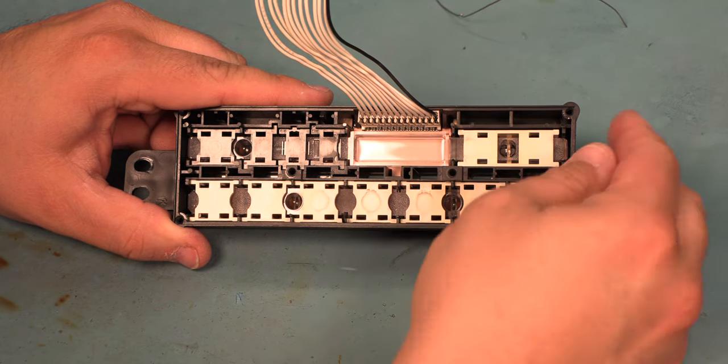We'll apply heat to the pad where we put that drop of solder. We'll place the transistor so that its legs are above each of the three pads. And then we'll remove the heat. Finally, we'll use a small amount of fresh solder to tack each of the other two legs in place. And for the last one, we'll repeat the procedure.